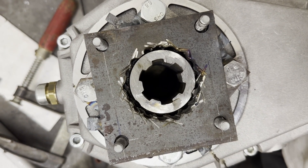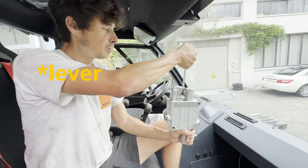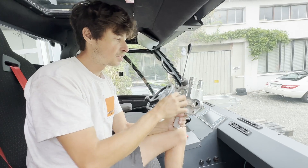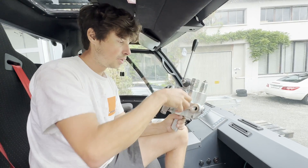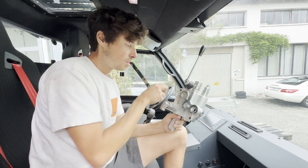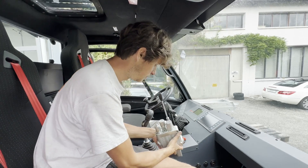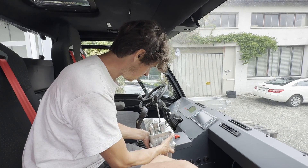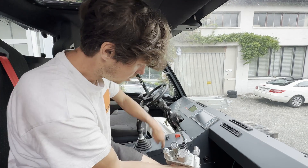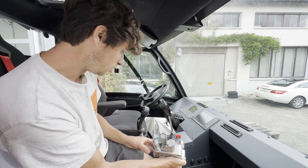We'll find out soon if this works. This big lever is for forward and backward. There are four hydraulic hoses we need to attach — going to the winch and to the pump. We'd like to have this lever somewhere here in the cabin. The hydraulic lines are going down there in the middle of the tunnel — maybe cut a hole here and attach this as solidly as possible.